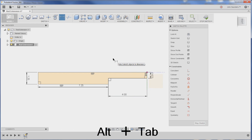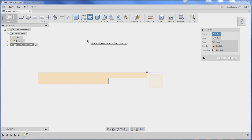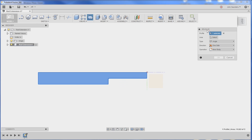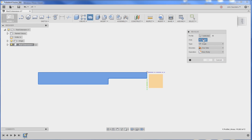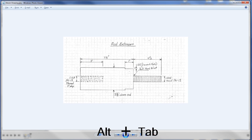What we do now is revolve this - it's really cool. I'm going to go to Create, Revolve. If you don't know what Fusion is asking you to do, let your mouse hover in the white area - it says 'select sketch profiles or planar faces to revolve.' So I want to revolve this profile, then I go up and pick the axis - select an axis - and I want to revolve it around this. Boom, click OK. That's the basic rough shape of the part. You can create that in 14 seconds when you get comfortable in Fusion.